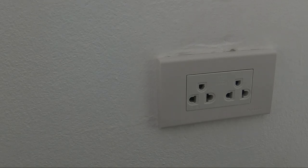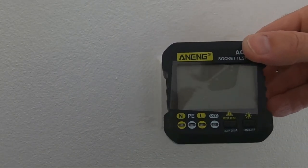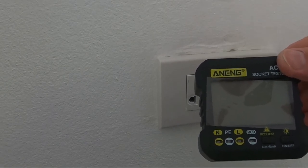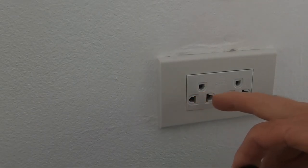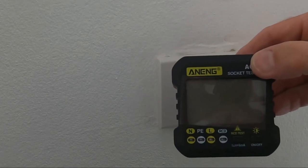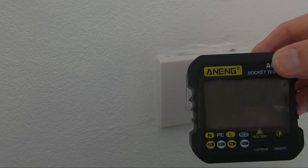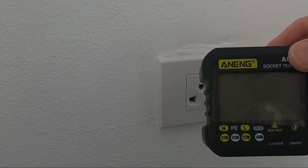Now, at the suggestion of one of my subscribers, I bought myself a very inexpensive socket tester, which will do various tests automatically to check that the wiring is correct inside there. And it'll also do an RCD test, so you press a button and it deliberately shorts itself in its circuitry to make sure that your RCD will trip.